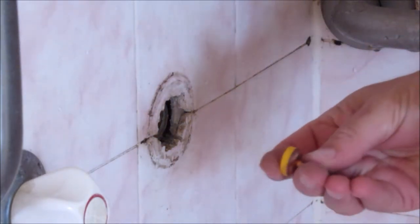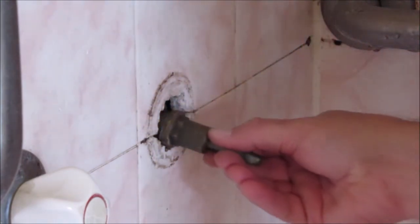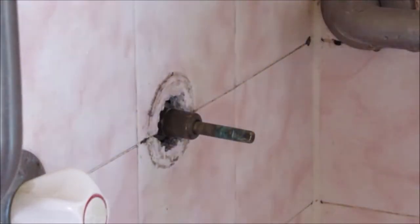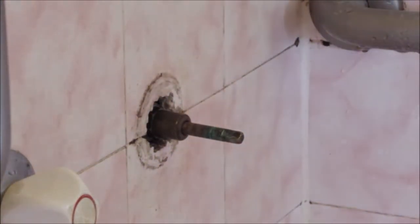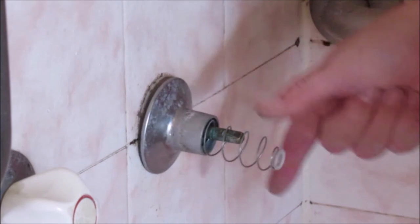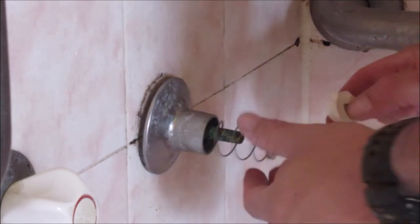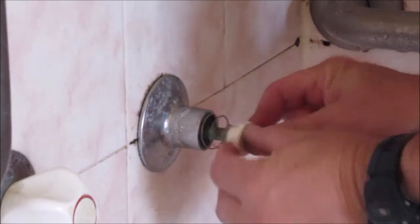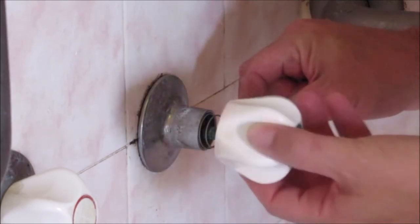I'm going to use one of these washers that I've been told work really well. That just goes back in there and then the tap assembly just screws in. So we have this outer cover with a spring on it, and then there's this white piece that slides onto the shaft - it can go in one way, and then the handle goes over the top of that. This is what actually grips on the handle.